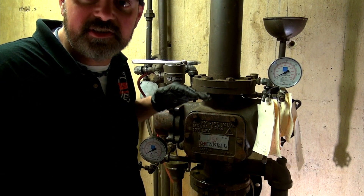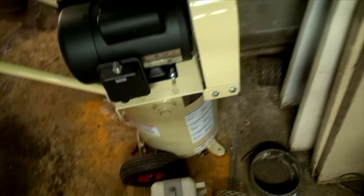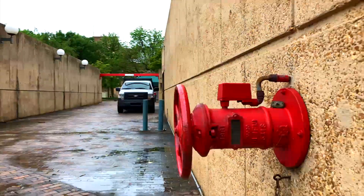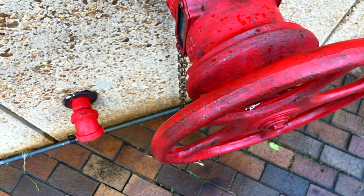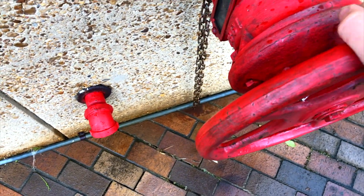We've got the air coming in. After the air fills the system up, then we can bring in the water. Now it's time to get some water on this thing. We have to open up this wall post right about here. That dry valve was just one type of dry valve — there are multiple dry valves out there. Right here we have a Tyco DPV1 push button. All you have to do is push this button and it resets.